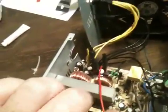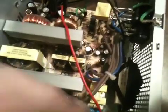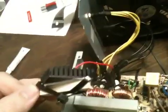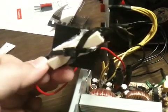You cut all the red ones but one — the red is the 5-volt line. What most people suggest is to run it to a 10-watt, 10-ohm resistor, one of those ceramic sandbar resistors. Basically, you run it into that, which creates a load on the 5-volt line and helps push the voltage up on the 12-volt line. I put thermal compound on it and stuck it to an old CPU heat sink. It gets warm to the touch but shouldn't get too hot.